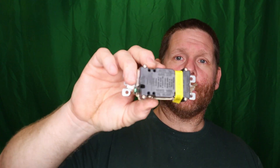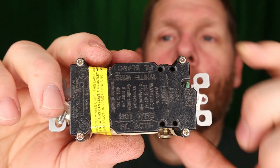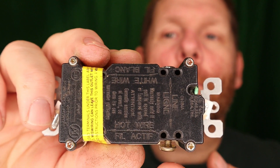That's my reasoning, and I had a comment: 'Well, you say GFIs are fine.' I'm not cutting my GFI open, but there is a plate inside this GFI. Right in there — see if I can get it in frame — there's a plate. When the screw is all the way out, you can see it. There's a plate in there, and up against that screw is another plate. When the wire gets in there, it crimps down and tightens up around it, and pretty much there's no way for it to come out. Obviously with anything, I've seen it come out, but if you tighten it and crank the hell out of it, chances of it coming loose are pretty much slim to none.